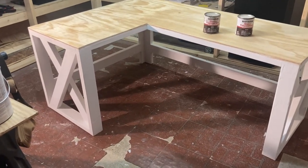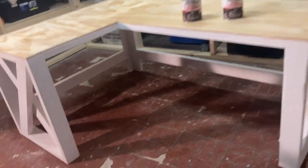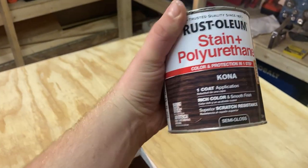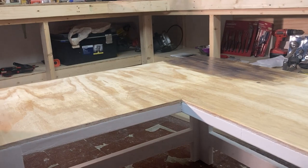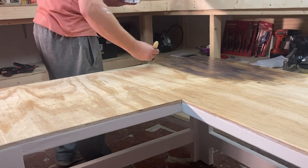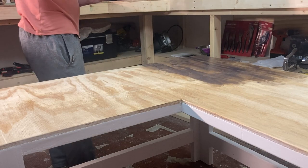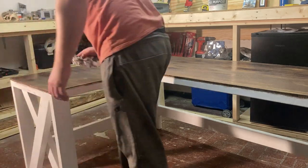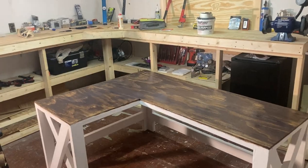We did get the paint done — now we just need to put the stain on top. I've got this really awesome stain I love, I've used it for a lot of things — it's called Kona. It comes out this bluish color when you first open it up and start putting it on things, but as it dries it gets this really dark brown color and it soaks into the wood really well. I'm going to do two coats — the can says you only need one, but I'm going to wipe off the excess and then do a second coat, and I'll probably put a third coat on the paint as well.